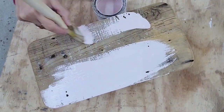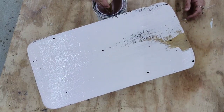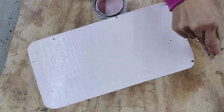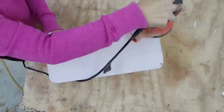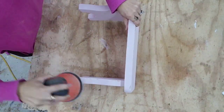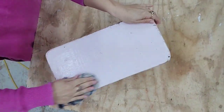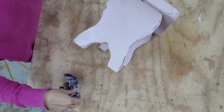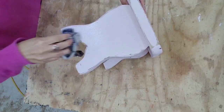Now I'm going to paint it pink — the same Camel Coral color I painted the legs on the other stool, so it all ties together. I'm putting two coats on the entire stool. Next I wanted to distress it using 220 grit sandpaper, hitting all the edges and the whole piece just to smooth it out. I don't like to overly distress — I hit the edges where it would be naturally distressed. Then I take a wet rag and distress it a little more; I like the way wet distressing looks more natural. I am just so excited with how cute this little stool turned out.